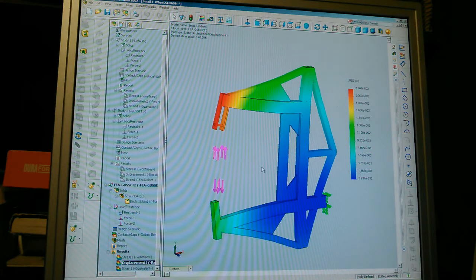So I thought, okay, well, that's easy enough to do. I can just go buy a length of 1-inch tubing. Because we're dealing with such small, thin material, these main arms are 2x1 material, probably 100 thou wall thickness, and the gussets, the easily available material that I got, was 100 thou wall, 1x1. They tend to buckle in the design too, so I've thrown in some plate, top and bottom. And then this stiffener in here stiffened things up too, similar to the first variation of gusseting, but it maintains a lot more open area.